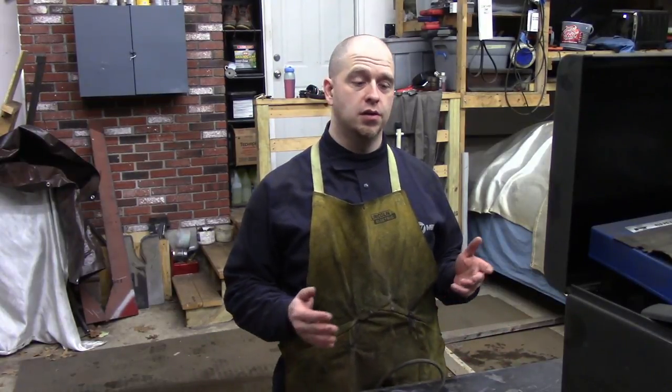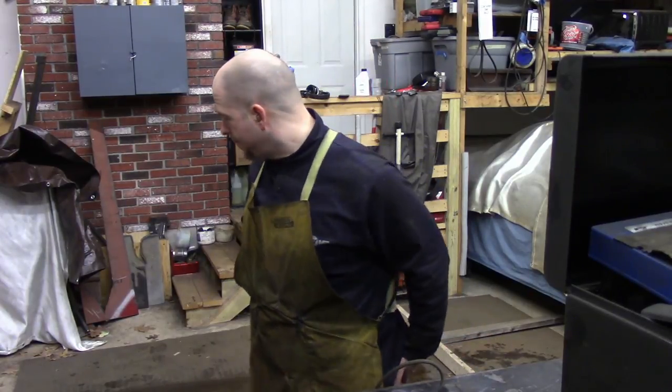Hey guys, I've got a quick one here for you today. The premise of the video comes from something I've always heard: to use a specific low alloy welding filler metal when joining dissimilar metals, such as a higher carbon steel or alloy steel to mild steel. This is important when building swords because I use different types of steel for the hilt versus the pommel versus the blade. I've had good luck using this low alloy filler but I've never actually tested it, so that's what we're here to do.